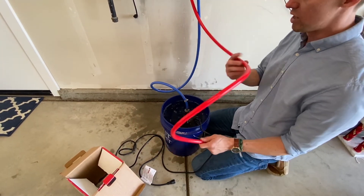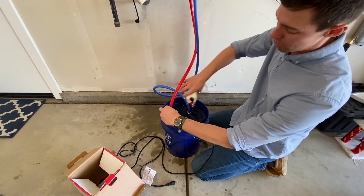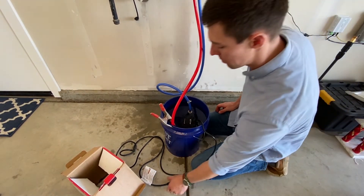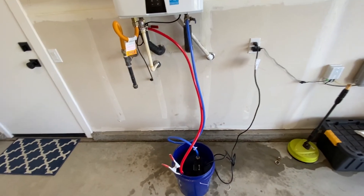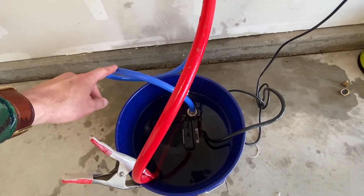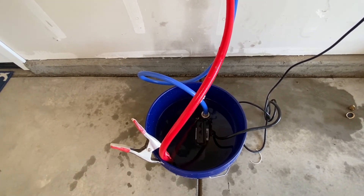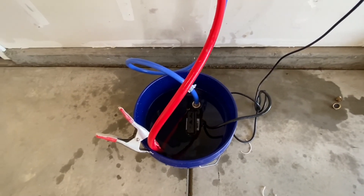Here's my submersible pump. I'm going to attach the inlet side of the hot water heater to it, then drop it into the five gallon bucket of distilled white vinegar. There's a lot of air in the pump. Then I'm going to put the outlet side of the hose into the bucket as well. One thing you want to do is make sure you clamp the hose so it stays in the bucket — in the past I've had the hose come out and distilled white vinegar spew all over the garage floor. Then you're going to plug in your pump. You've got your pump inside the five gallon bucket running, your hose taking the distilled white vinegar up to the unit, and your outlet valve returning it to the bucket. Hopefully the vinegar is running through the unit and removing any buildup in that heat exchanger and copper pipes. We'll check back on this in about an hour.